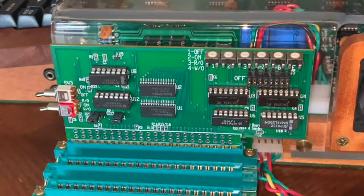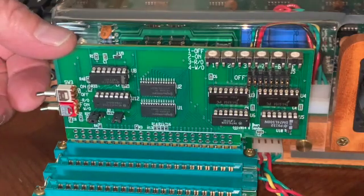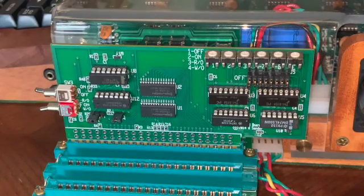We turn the E block switch on. We switch the 0 block toggle switch to on. This moves the onboard DRAM memory to the FRAM on reset. Next, we load BASIC into the E bank.